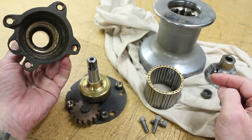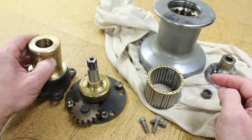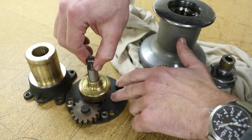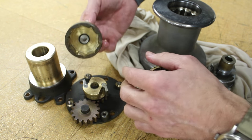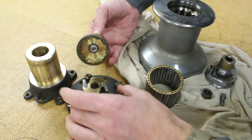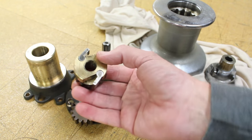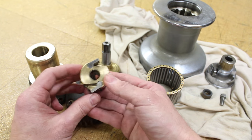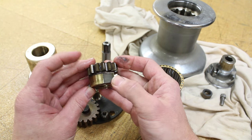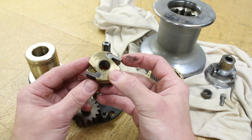Once all four of the screws are removed, you can then slide the spindle off of the lower portion of the hub assembly. You'll notice this is the lower pawl action for the two-speed winch — there you have the pawls and the ratcheting mechanism. At the bottom of that centerpiece with the pawls on it, there is also a gear. That gear engages the lower gear, which in turn spins the drum assembly, giving you a gear reduction rather than a direct drive.